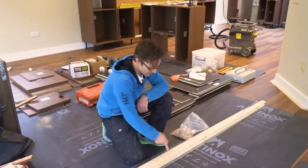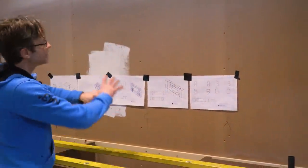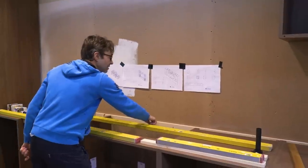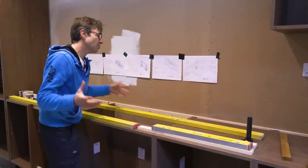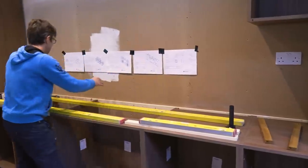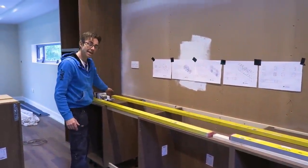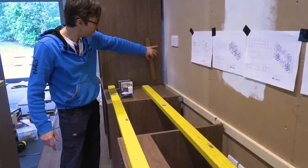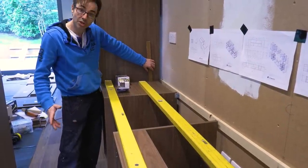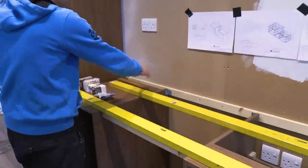I'll have a center mark — in my case everything's centered. Here is the center of my kitchen, and you can see the MDF patresses that we've got, which enables me to fix back everything really nicely, especially the batten. On my batten, before I screwed it up on the wall, I had all my points on there — my carcass for the sink, space for the dishwasher, then my next unit. I've also got my panel spacing set at a millimeter and a half more than the panel, just to allow a little bit of breathing space.